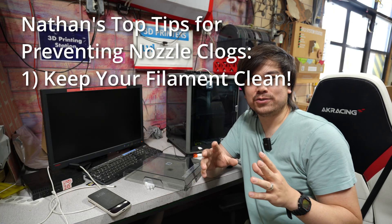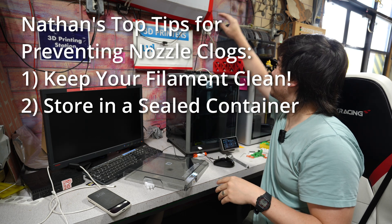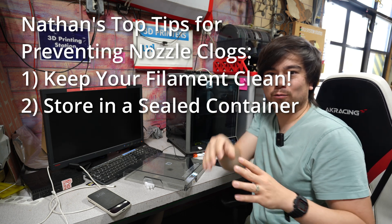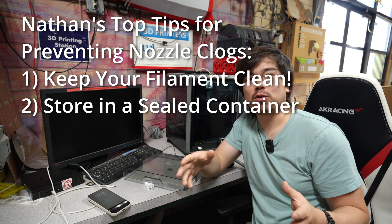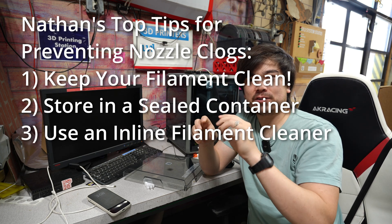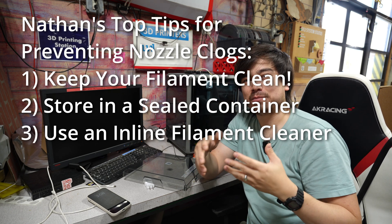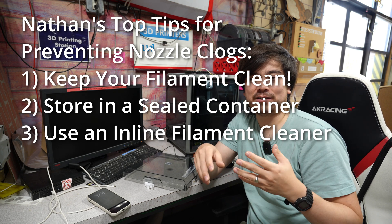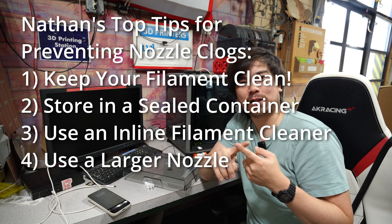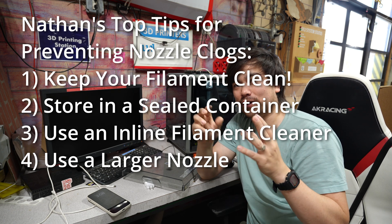So we've had some advancements in 3D printing that make this less of an issue. However, you're always going to want to keep your filament clean, especially in less-clean environments. Your solutions are: keep your filament clean and don't leave it out in dirty or contaminated environments; keep it inside a sealed enclosure like an AMS or any type of filament box — even a cardboard box should work fine. You can also use a filament scrubber — a little device that you clamp over your filament and it pulls it through a sponge to clean it off as you're printing, though you'd need to keep replacing and cleaning it. You can also use a larger nozzle to help pass potential clogs more easily — 0.4 millimeters is really small and somewhat easy to clog.